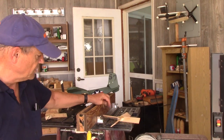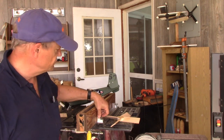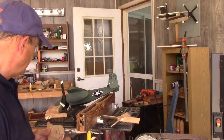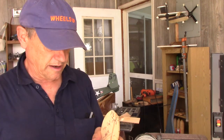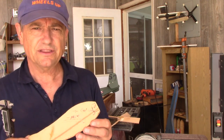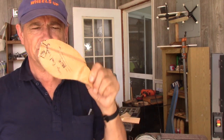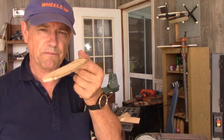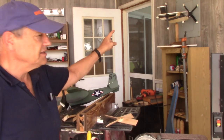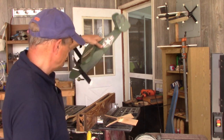We're back at the table saw. I've got the little brackets installed with the screws on both of them and they're adjusted. I make bird wings here — these are just cut out of two-by-fours. I'm shooting for about 0.193" on the thickness. Much thinner than that and they split or warp. I also make props for my airplanes — you can see the Dash 8 up there with the four-bladed prop and the B25 with the three-bladed prop.